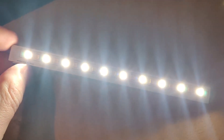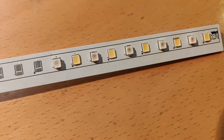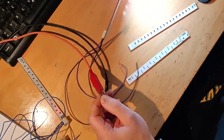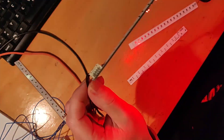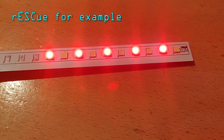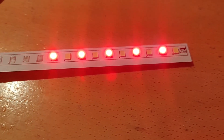If you don't want to have both colors on both front and rear, you can put either half the red LEDs or all of the red LEDs on the rear light — it totally depends how bright you want it to be. Option number two for the PCB is to solder every second LED as red and the other as white. This way, using half LEDs in white and half in red, you can have both white and red LEDs active. This means my PCB lights support direction-of-riding switching with different lights. There are a few hardware solutions available that will switch the front and rear light for you — I did not install any in my board and I don't plan to, so don't ask me about it. There are solutions available for you.